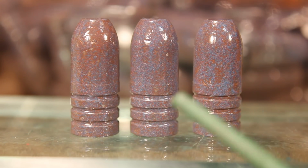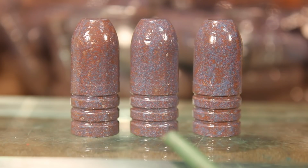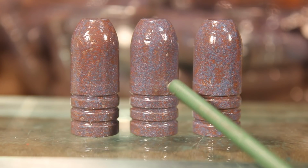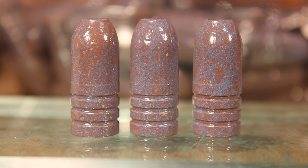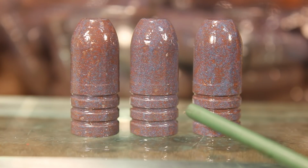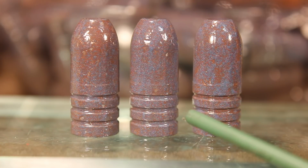But also notice that because there's no crimping groove, a bullet of this type means it's a black powder design. Well, we can crimp right over that little shoulder right there. So that's good. But notice the little grease grooves, they're not very abundant. So it only holds a little bit of lube. Now that might be okay with an Alox lube, but if you're shooting black powder, you need a lot of lube. And these little grooves don't quite make it.